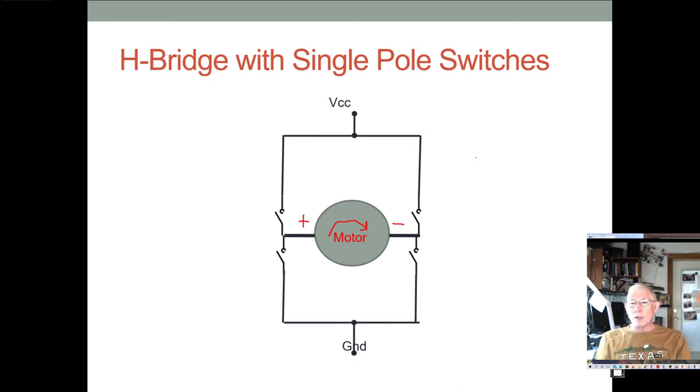It's pretty quick, and there are other reasons driving that. But obviously you can't go very fast because the motor is a mechanical device, and at some point it's not going to respond to very high frequency signals. Obviously a few kilohertz is about all you can do with a real DC motor.